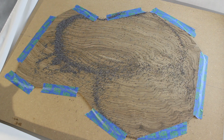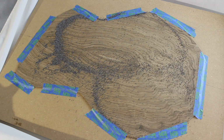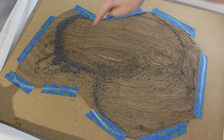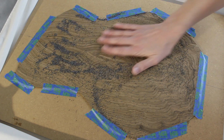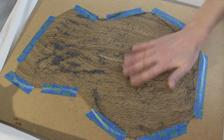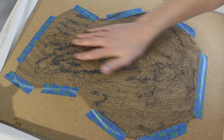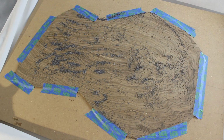Kind of destroyed the pattern a little bit, but at 80 Hertz I had a very clear dipole going on. At a much lower frequency there was a hint of just some activity over here. I might do that all again actually. Let me just reset that and see what happens again. But I think you can see how different the vibration is when we've got it constrained.